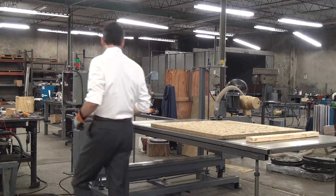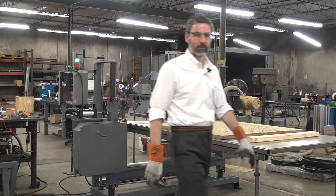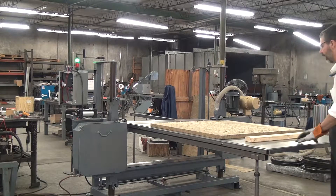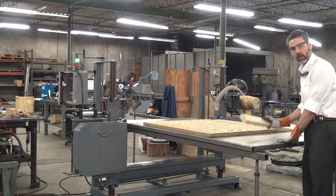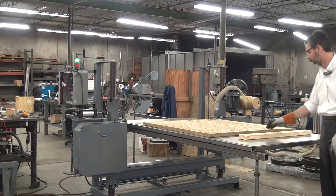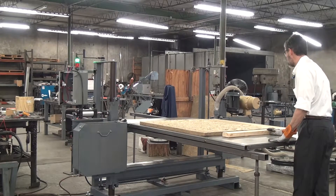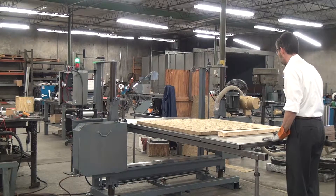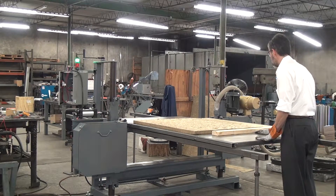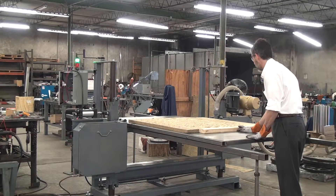Dust collection on, please. Start the bandsaw — green light, everything's good. I'm going to cut at a conservative rate since I don't have experience with this blade on this material. I figure it's better to get a good quality cut than a fast cut at this point. I also have a pusher stick here. There's a lip to keep the material from going sideways due to the force of the blade. Making a moderate amount of dust — the dust box is just catching it.